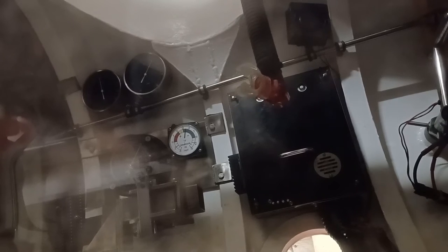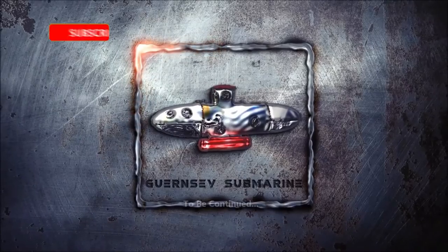It looks like I've dropped about a quarter of a PSI of pressure. The barometer has stopped on the little red blob, which is my secondary marker. We'll leave it at that and I'm going to wait — in fact I'll just leave it like this overnight. It doesn't look like it's moving so there's no obviously large leak. There could be just a tiny tickle but it does look like the boat is tight.